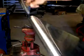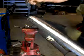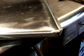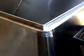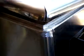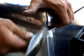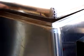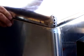When working your corner, find a suitable dolly to fit the part. This old wrench works great in this situation. After working the corner on a dolly, tack and tap the bottom to shape your corner. After tacking the corners at the bottom, fit the lid to the box and adjust as needed. After tacking the lid, recheck the fit on the box.